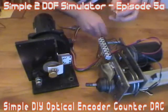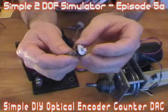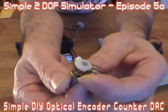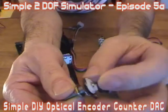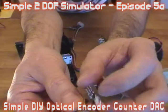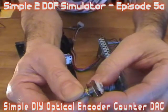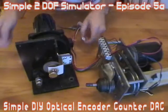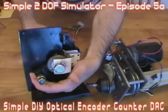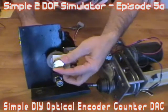What would happen with this is that because it's an analog potentiometer, the brush in there which brushes against the carbon — which divides the voltage — eventually wears off and buckles up. If it gets beyond the extreme point, the brush can fold right over and then get destroyed, and the whole thing just cracks up. Especially if it slips a bit and the crank gets to an extreme, it can also snap the potentiometer.